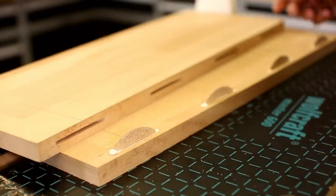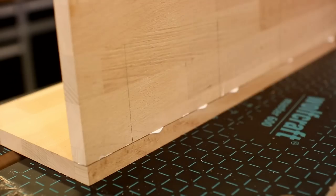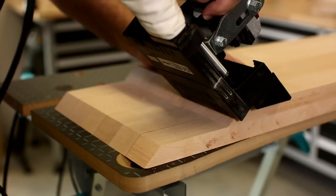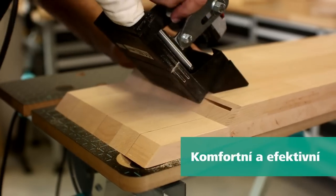The joiner attachment takes just a few steps to mount. The standard adapter is compatible with all one-hand angle grinders with M14 spindle thread and tap bores for handles on either side. The lateral machine holders, which you fasten to the bores, ensure a secure grip.